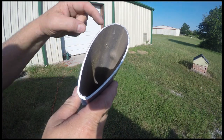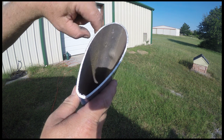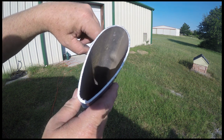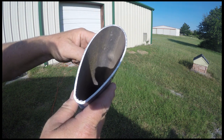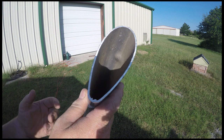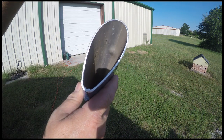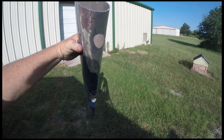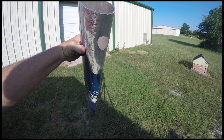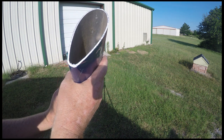Now you can see the dent from the inside. Again, that's not something that you can hammer out or straighten up. This is a lift strut. I don't want anybody dying. It could cause a crack early, later in its life, so that's the reason we cut it up. But there's a dent that somebody filled with Bondo, and we're not going to have any of that. That's the dent that killed this strut.